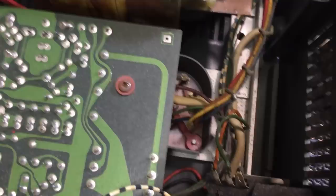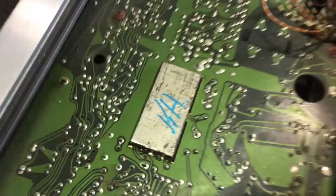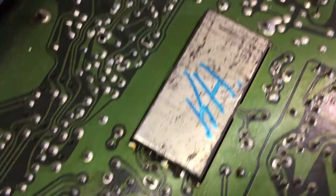There's not much here — it's all on the PCB. This is obviously the FM front end. The audio connectors: tape and phono. It'll probably do with a bit of a clean-up, and I'm sure this thing has suffered the usual dry-joints disease. But this is old-school PCB, which isn't that difficult to trace. Nothing too dramatic on here — it just depends on how easy it is to remove this thing from the case.